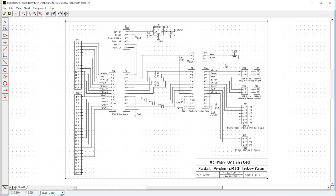Same thing with the tool setter probe. So he's going to be wired in here. And he just gets a pull-up resistor to 5 volts. So I'm pulling 5 volts off of this guy. And then he'll go 5 volts, ground as the probe opens and closes. So when the probe is at rest and not touching anything, it's a normally closed device. So then this line will be pulled low, and then when the probe gets touched, it opens, then the 1K will pull this line high, and then that will trigger that the tool setter touched.